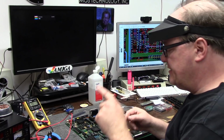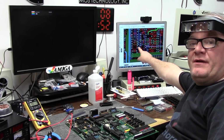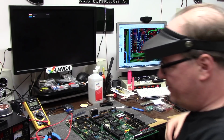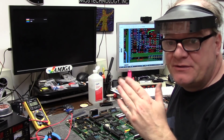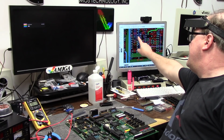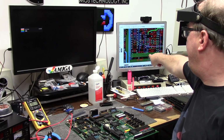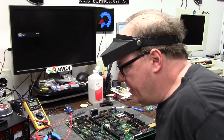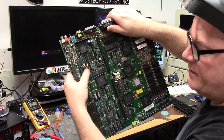There is some significant battery damage on the top pin, which would be around this area, this pin. The problem with that, or the luck with that, is it's a ground plane right there. That pin is inactive, which saved my bacon because all this was etched out. I do have one line up here, this one that runs down, kind of got busted. I have to take it to R470. It's a 3.3 ohm resistor.